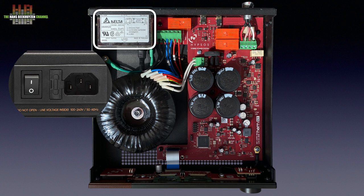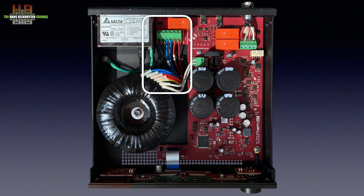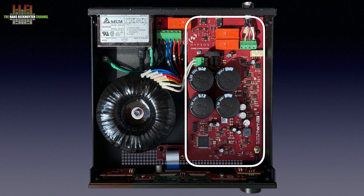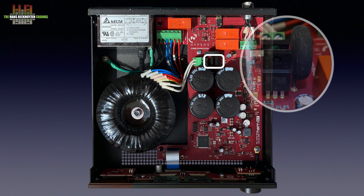Inside we see a two-stage filter integrated with the mains panel on the rear. From there the AC voltage goes to a circuit that measures the transformer output voltage to switch between 230 and 115 volts AC by switching the primary windings in parallel or in series. The transformer outputs 34.85 volts AC over the two white wires. On the main board I see an ARM microprocessor, four 4700 microfarad capacitors, and a set of two Schottky barrier rectifiers known for being fast and able to deliver large currents.